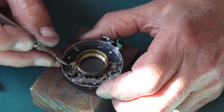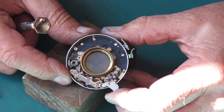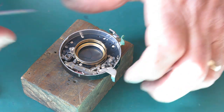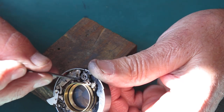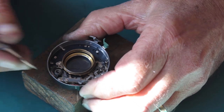So now if I cock this and press the release, the shutter will fire — which reminds me there's one area I need to lubricate. That's on that little arm. I've run some molybdenum paste down the edge of that so that as the gap's cocked and as this comes round, it runs down there smoothly.